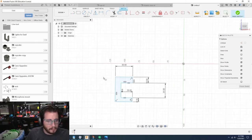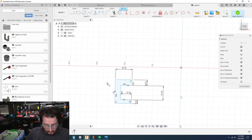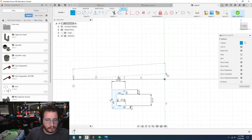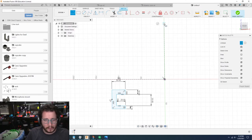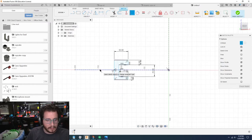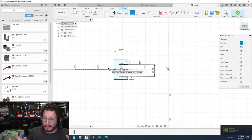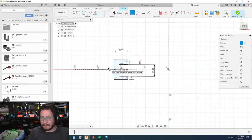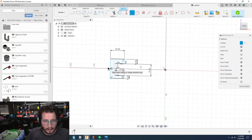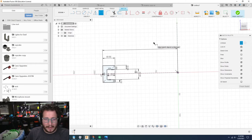We're going to grab a point and put this point in the middle of the back. I hit L and X to make sure I have a dotted construction line. I'm going to grab that center point, come out a general distance, hit the escape key, then hit L again so I can come up as well, because we are going to mirror this thing. We're going to take this point here and make it coincident onto here. Since we know the unit is 380 millimeters wide, we want to give her a little bit of leeway — so we're going to go to like 385, which should give plenty of distance. 385 divided by two is 192.5, so we need to hit a distance between the two points of 192.5. That is the basic of what we're doing here.